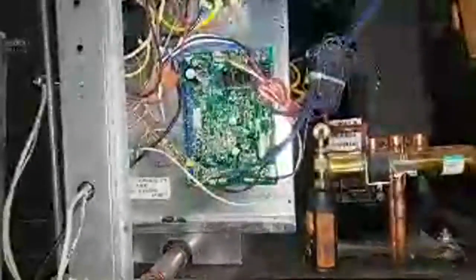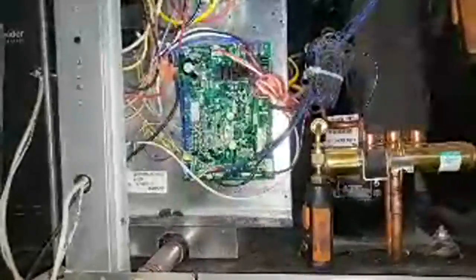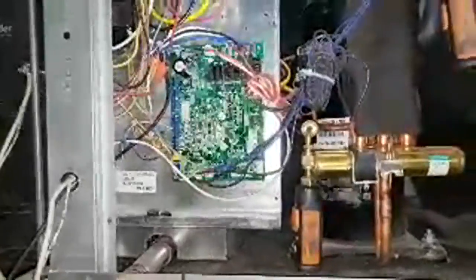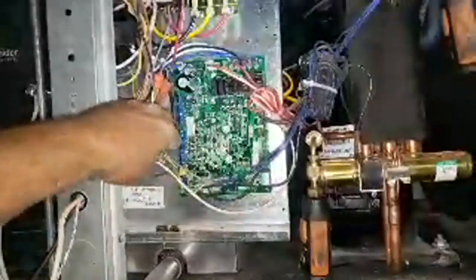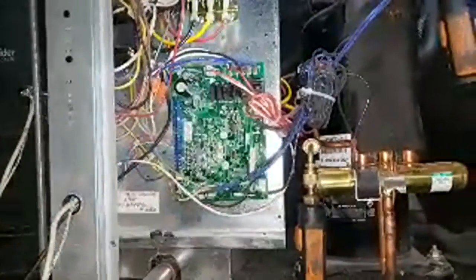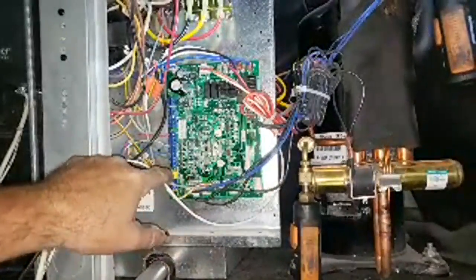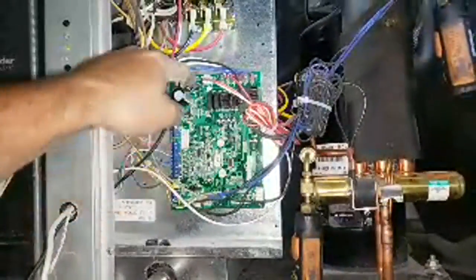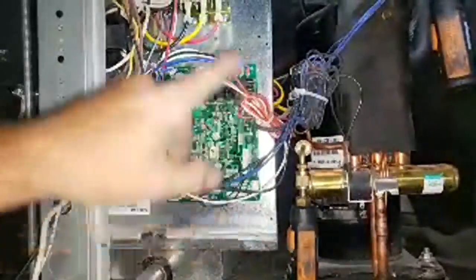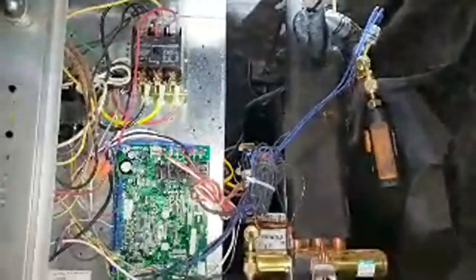I don't think there's going to be anything wrong with this unit. It does have a circuit board. We've been getting a lot of different brands that have been starting to go in around here — the water source heat pumps. Some Bosch units. There are Aeon units I've been working on — one place has a couple hundred of them. I've been getting a lot of issues with those being overcharged from the factory. That could be a video in itself. It looks like this one is similar to Aeon where they have water temperature sensor probes, air temperature sensors, stuff like that.